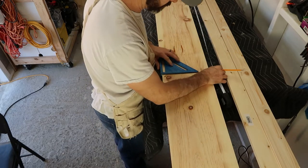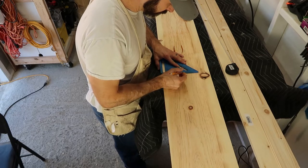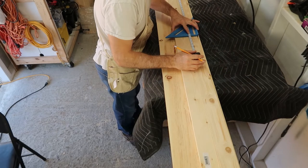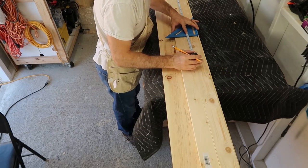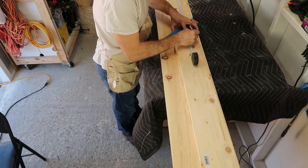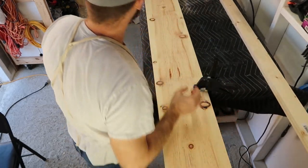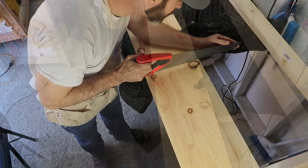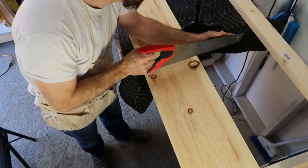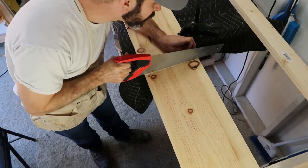It was an adventure and I really enjoyed making this bench. Here I am making the seat — I'm doing this first so that I can glue it, because it's gonna have to dry overnight. I'm making the cuts here. You can make it any size you want — I went 52 inches because that fits nicely underneath the kitchen table. You're gonna cut it about an inch, inch and a half short at this portion because we're gonna frame it out.